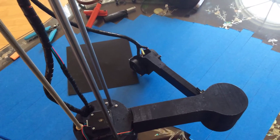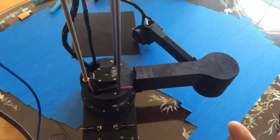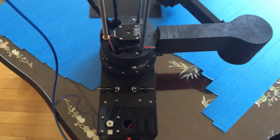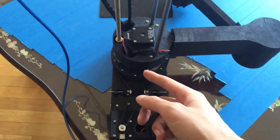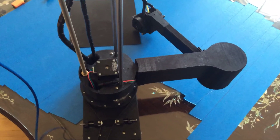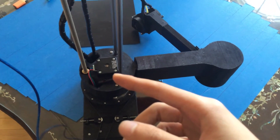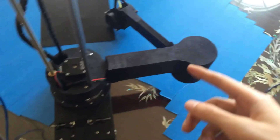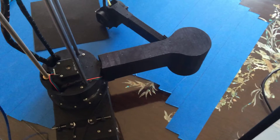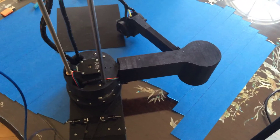What I've got here is a RAMPS board running off of A4988 stepper drivers at 16 microstep. There's a 16-tooth pulley back here, 198 teeth and 126 teeth on the belts. What that essentially means is that if I did my math right, the shoulder has a steps-per-degree of 110 steps per degree, and the elbow here has about 70 steps per degree.